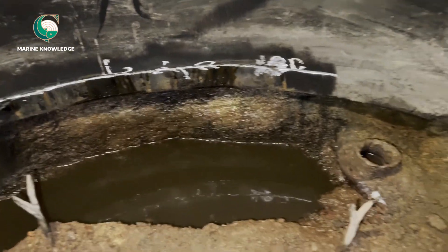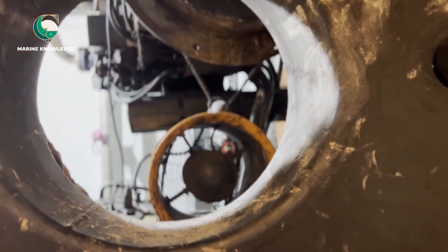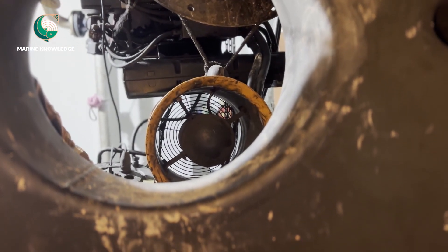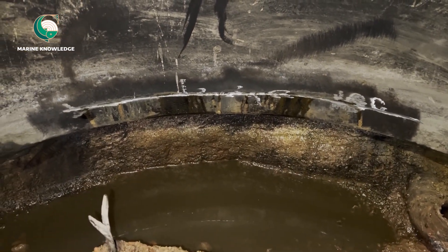The surface preparation has been done — we removed all the refractories and all the water has been removed. The area is ready for doing a hot work permit by completing all necessary steps: we need to ventilate the area, remove the water, and properly ensure the hot work permit is totally done and followed.